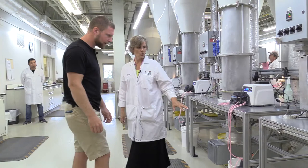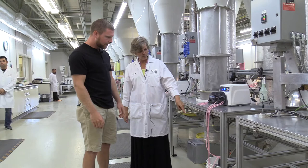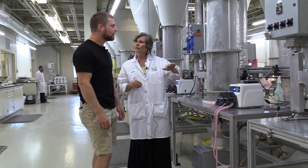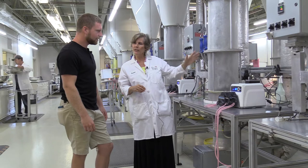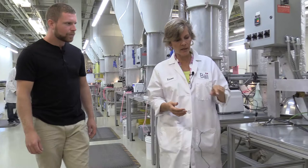What are you spraying up in here? It's actually a coating solution — it's a trade secret. Here we have our base coat and it's white, being sprayed through this pump to these nozzles. It comes out the nozzles as a fine mist, and as you can see it picks up a very, very thin layer. It'll go up and dry, come back for another coat. It's just a continuous cycle of very fine layers of mist, and eventually it'll build up to twice the normal weight. When we get it to twice the normal weight, we'll switch over and put the second coat on.